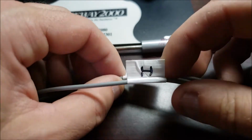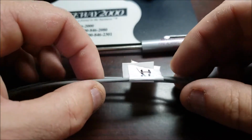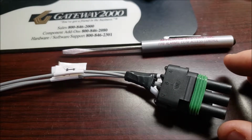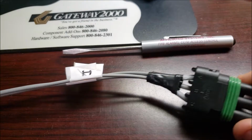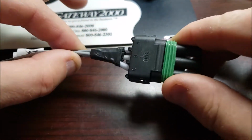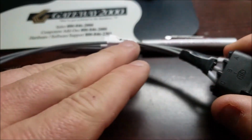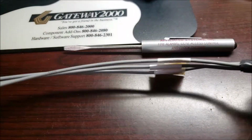I just used some white tape and kind of did that one a little bad, but it doesn't matter. Before I hardwire everything in, everything's going to be connected with spades and jumper wired to make sure it works anyways. So this just makes it easier to know what you're doing. Then I take this and I tape these together just to give it a little more stability from snagging. When it's all said and done, I'll come back with that split plastic black conduit stuff to shield the wires, and I'll put that over.